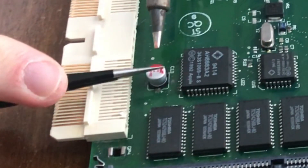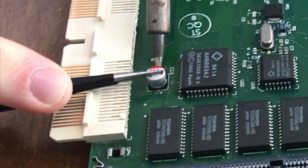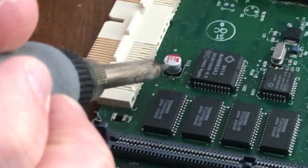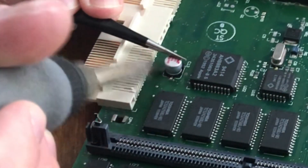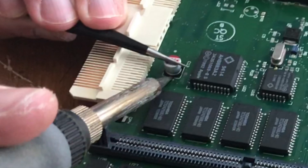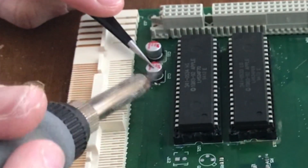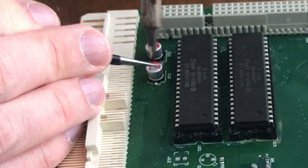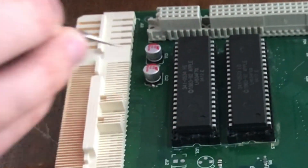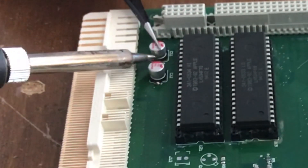Now I have placed a new capacitor onto the pads. I'm using solder paste — you apply the paste to the pads, place the component in the correct orientation, then apply heat to the pad. The solder paste will naturally gravitate to the pad and make a solid connection after being exposed to heat for a certain amount of time. Hold the component down so that it stays in the correct position. You'll know you're finished when you have a clean shiny joint between the component lead and the PCB. Repeat this process on all the other capacitors — it just takes time, do not rush. If your cap is not at a perfect 90 degree angle, you might not actually have a good enough electrical connection. I actually had one slightly crooked capacitor later in this video that caused the system not to boot. After reworking it, now it boots just fine.